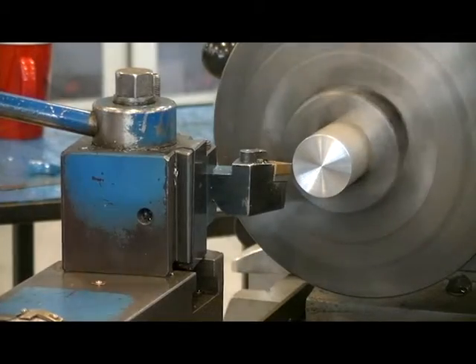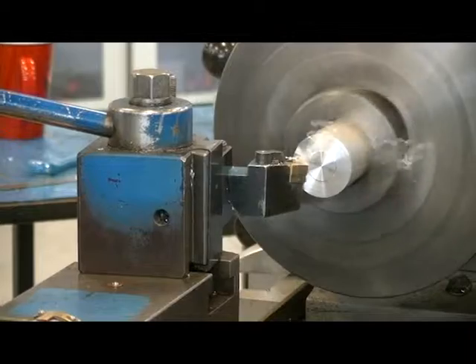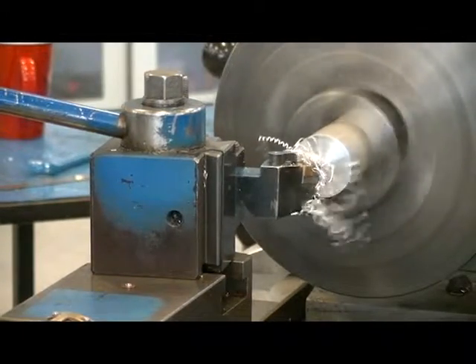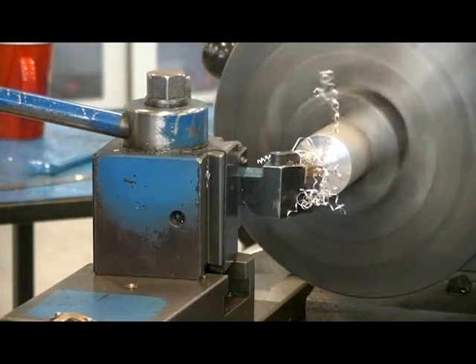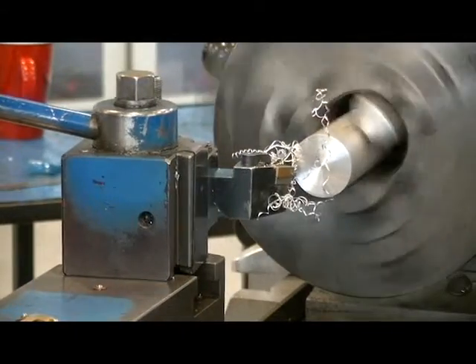Take a nice light finish cut to the center. This time, however, once my tool reaches the center, I'm not going to hand feed it back because I don't want to scratch or rough up my surface finish. I'm going to move the z-axis away from the part and then feed it back by hand on the x-axis.